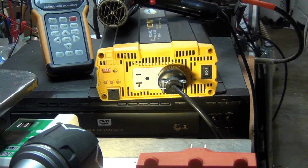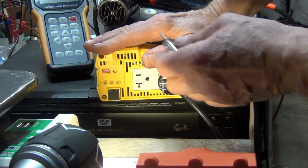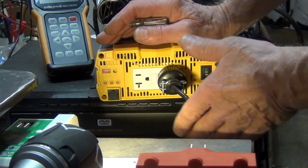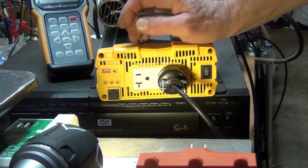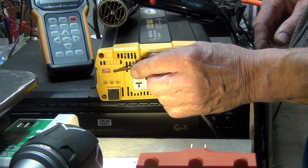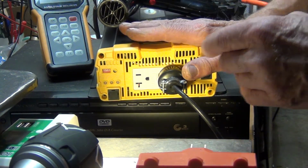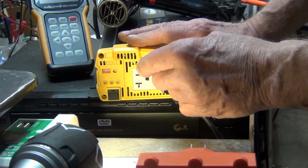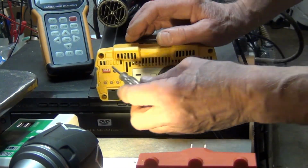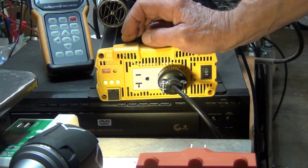Excuse me, cheers. So now the power is off, and the unit is only blinking. Whenever it blinks, it will draw a little power, and this is just pretty much to keep it alive. Okay, I'm sorry, I'm blocking the view here. Now this is how it works. This dimmer here, you can adjust how much load you have to put on this unit to turn it back on. Okay, so if you go all the way to the left, when you turn it this way, it will be the least load, or maybe it will even turn on completely by itself. You can try that. Let's go all the way to the left, and it will be on.